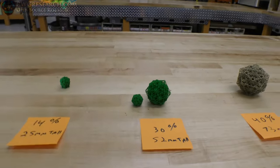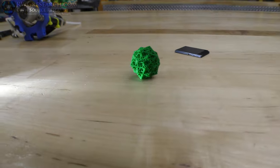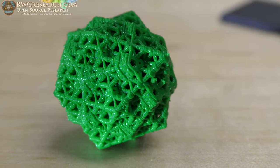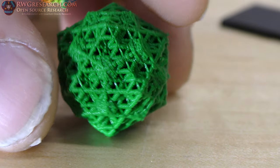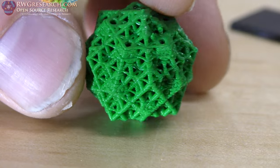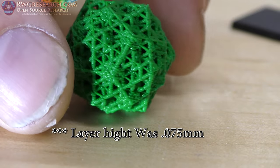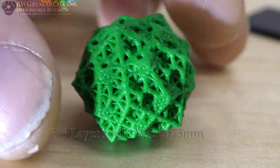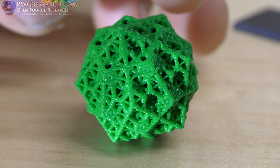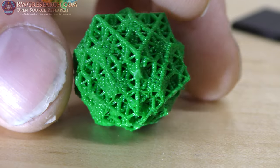I wanted to show you my best little one to date. I didn't bring it to the meetup because I didn't have it — wasn't finished, started the wrong one. Those extra little blobs and things, you can see the layer height. I set my settings really, really crazy — like things you would never really print with — in order to achieve this. The layer height was, I think, 0.13, and the nozzle diameter was somewhere around 0.18 maybe. I'm going to keep messing with this because I think it's pretty cool that you can even print something so small. I added this to the Thingiverse profile because I think it's pretty awesome.